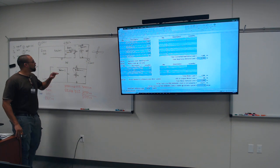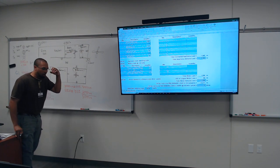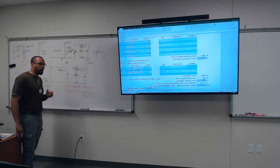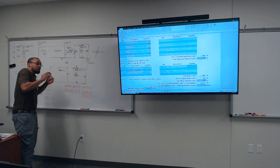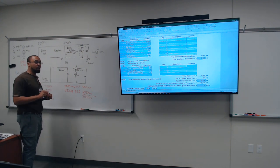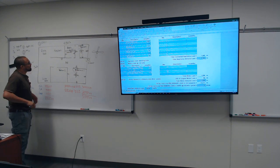So once I put all of the plugs in here, I'm gonna show you in the book. But all receptacles are calculated at 180 VA, which is 180 watts. So you know that value that I just told you. Now you're gonna have to figure out how many receptacles can be placed on a 15 or a 20 amp circuit breaker with that number of 180. We're gonna go to it, but don't jump the gun yet. It's a lot that we gotta unpack, like I said this morning.